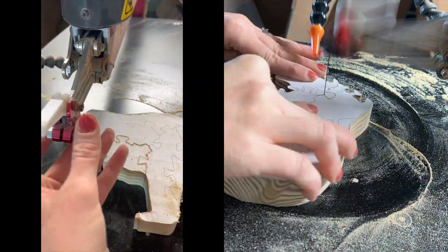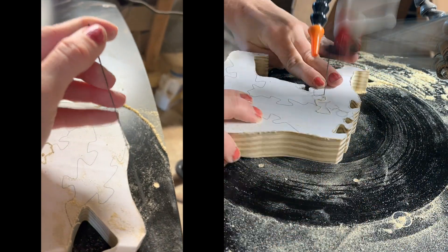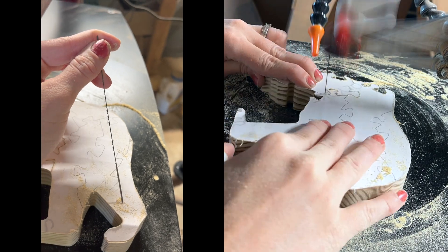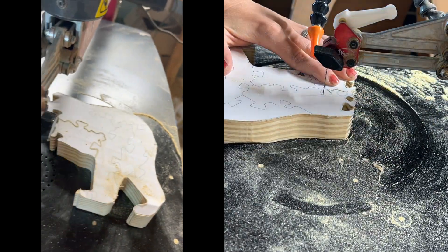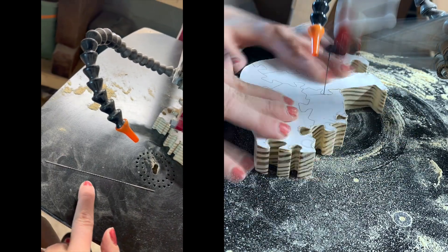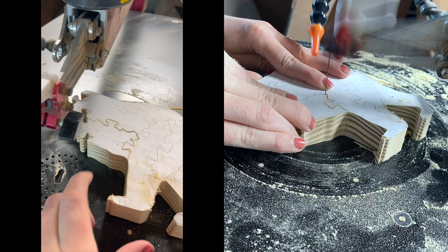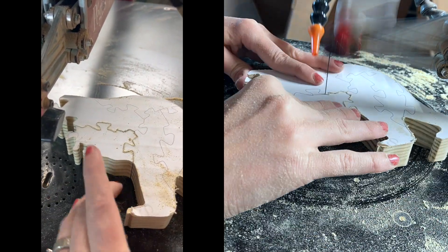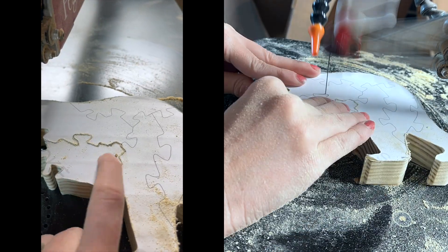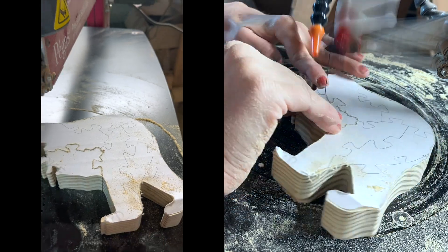I am more than halfway through this puzzle and I can tell that I am just struggling to get the blade through. It's starting to burn out a little bit, getting a little dull. In my experience the modified geometry blades last the longest and leave the least burning on the wood, but I'm impatient and struggling to get through so I'm gonna switch it out to a fresh blade — that's gonna leave less residue at the top too — and I will finish the last few of these pieces.